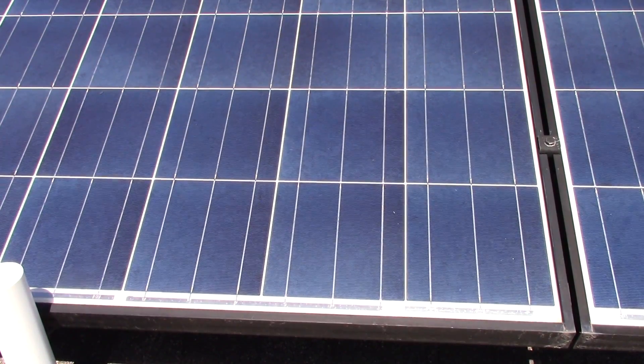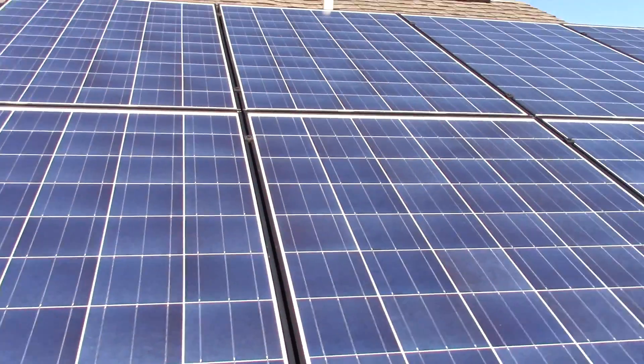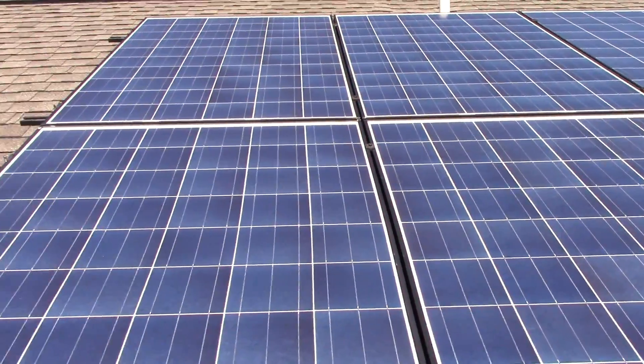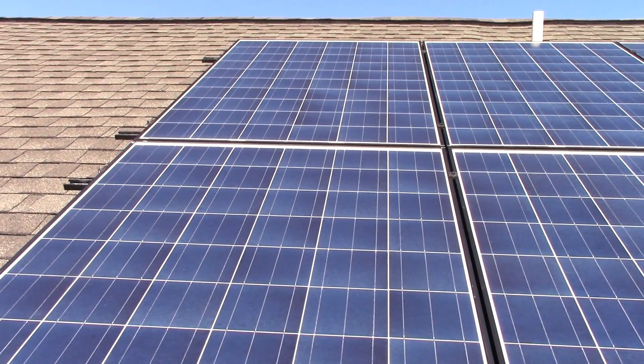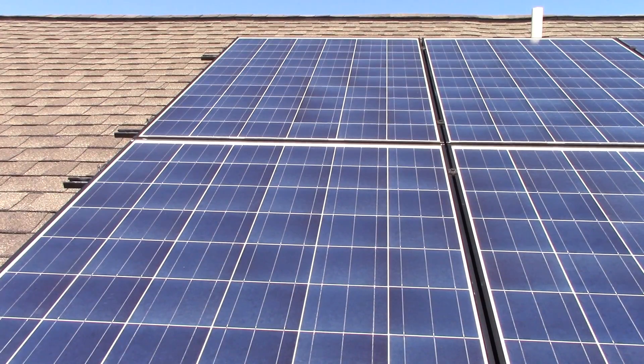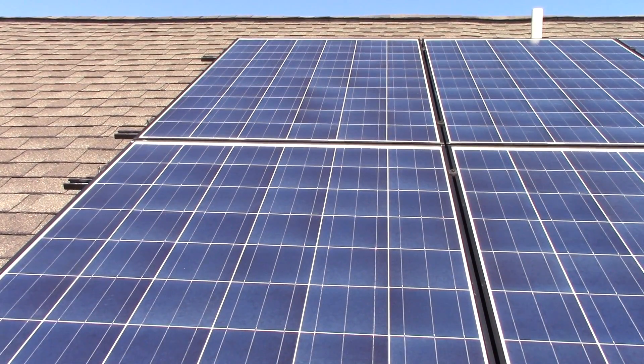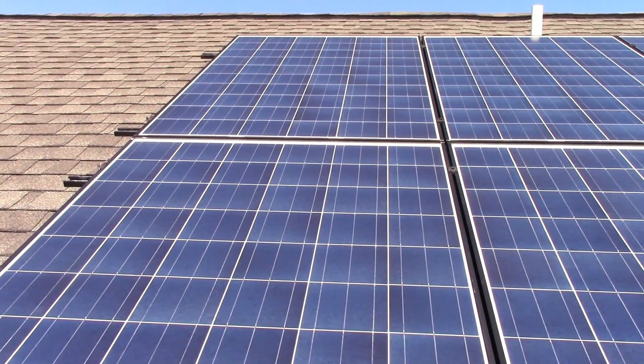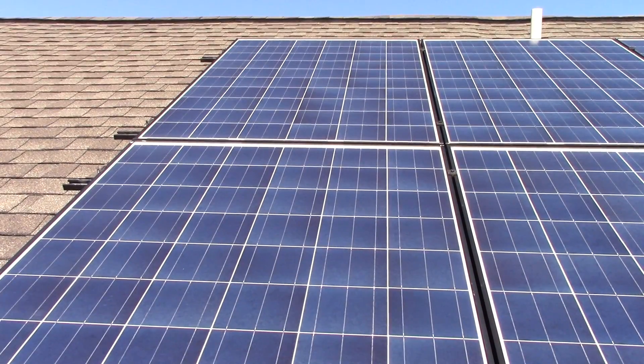You can see my solar array — it's all clean, there's nothing on it. This is a 3000 watt array and I'm making only 2100 watts right now, and it's about 115 degrees out. Two weeks ago I was making 96 amps output. This is what happens when you let your Classic get hot — I'm going to have to send it in for service. This is Phil with Solar Power, Electricity, and Electronics, and I'm going to holler at y'all later. Thank you.